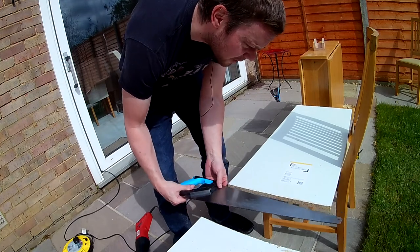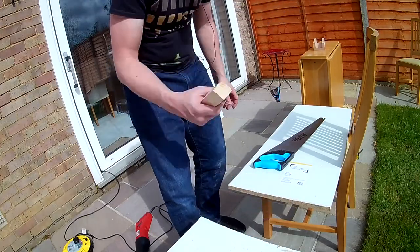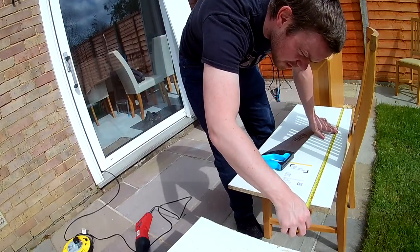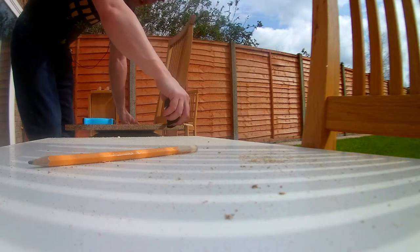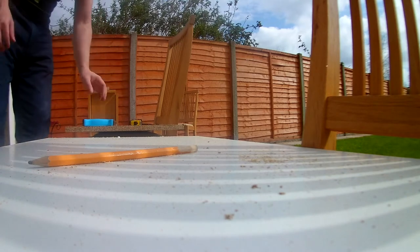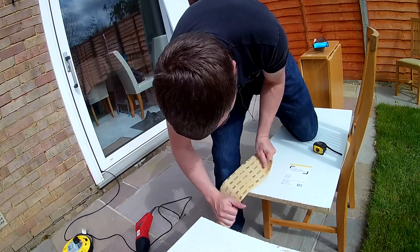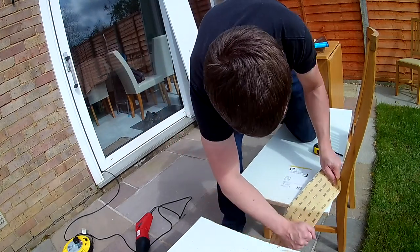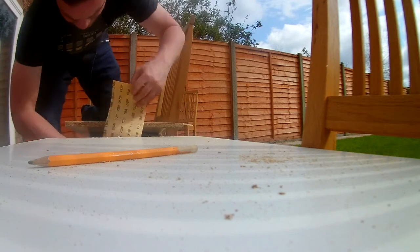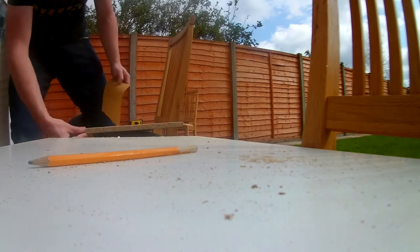Okay, it's not perfect but that's pretty good - I'm pleased with that. It's definitely good enough - it'll rest on the supports within tolerance. For length, it's a tiny bit under 95 centimetres - more like 94.7 - so that's going to be close enough. This is shelves in an airing cupboard, not something enormously important. I'm also going to give it a quick sand down to remove any loose bits that will catch and scrape and generally look a bit tacky. Yeah, that's much better and it's nicer than the other end.